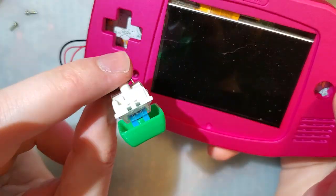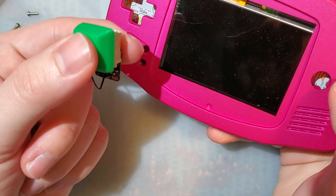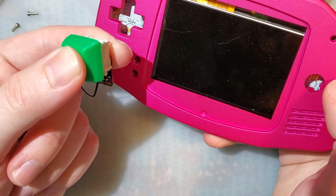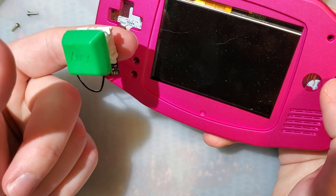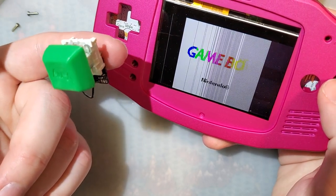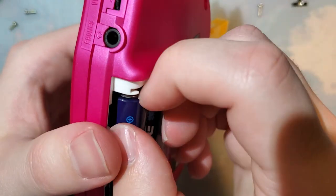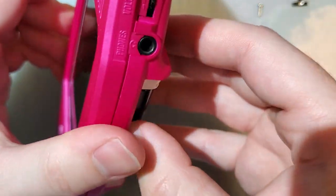But also, my power switch is now toggled on, so we have to press and hold this for at least 4 seconds for it to turn off, and then we can wait a few seconds and then try booting again, and it'll work just fine. Alternatively, you could just pull the batteries and that'll take care of that, but if you can even get that far, there you go.